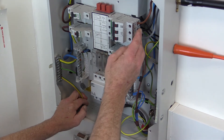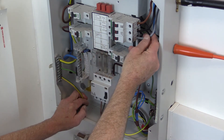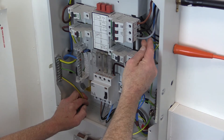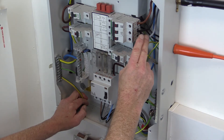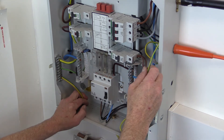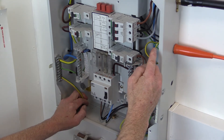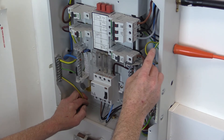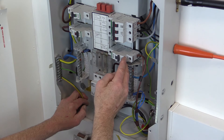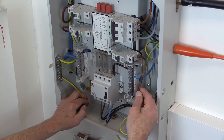Information will also be required to identify the type and composition of each circuit, conductor type and size, etc. Also the methods used for protection — basic and fault — and information necessary for the identification of devices for protection, isolation, and switching, including their location, and also information on any circuit or equipment vulnerable to the tests.